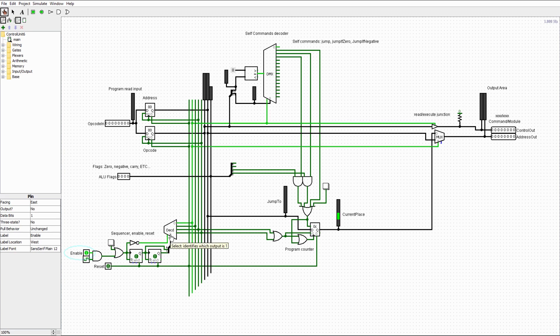The decoder is only enabled when the clock is off, for timing purposes. If it's only enabled when the clock is on, you'll have bad race conditions that will ruin your control unit. There's also a reset pin used to reset all of the state in the entire control unit, and a debug button that steps through the state.